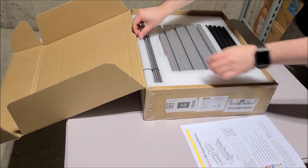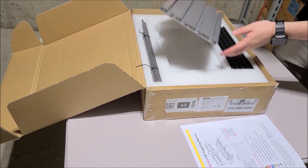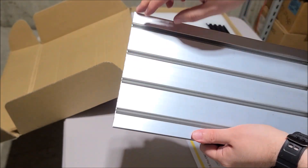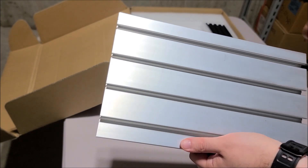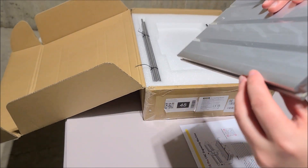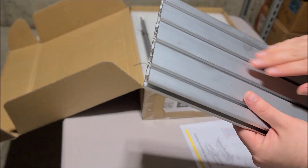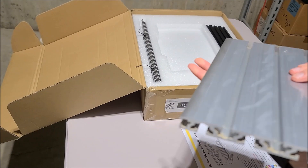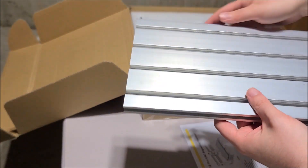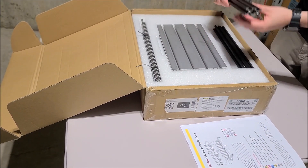We have all our linear rails and everything on one side, plus the lead screws. We have the bed itself which, as the name implies, has a work area of 180 millimeters by 300 millimeters. This is a pretty chunky piece — a little bit dirty with some schmutz on the underside. Everything uses V-slot extrusion, so these are all the parts of the frame and bed.